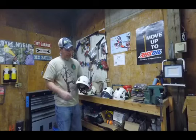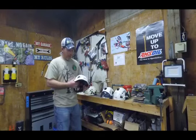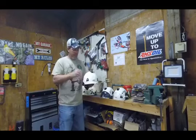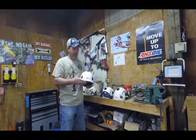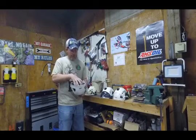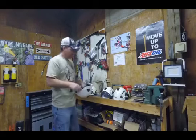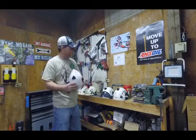This is a Vertex Best. It's the same as the vent style except it doesn't have the vents in the sides, which serves two purposes. First, it's electrically rated, so if I'm working around power lines there's no chance anything's going to come through — it's insulated. Second, if it happens to be raining, it's not going to leak in through the vents and soak my head; it's going to run off the front and the back and keep me dry. It's also got the center adjust with two dials that keeps everything centered so the helmet stays on the center of your head. I might note this is also a suspension style — your head doesn't touch the top, so it relies on deformation of the shell to absorb impact.